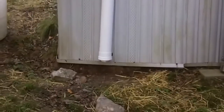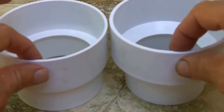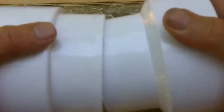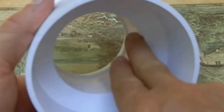This right here is a water trap. I have two adapters that fit together and close, choking the flow down to a three-inch hole. These are the two PVC adapters I use — they are four-inch and three-inch, and it just so happens that the three-inch one fits right inside the four-inch one. This creates a choke point, so all I have to do is put a three-inch floating ball in the pipe, and as the water rises, the ball will float up, get stuck right here, and shut off the water flow.